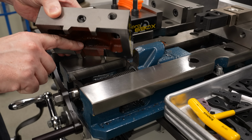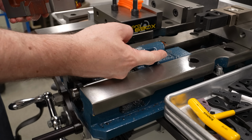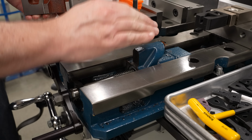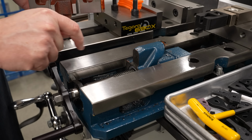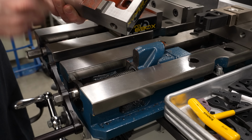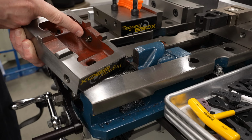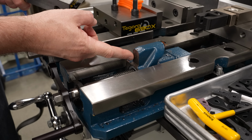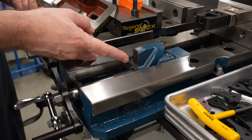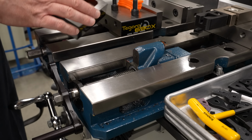You can see there's a little kind of a half sphere pad in here, and there's a hook on the front of the nut that's designed to actually push forward and pull the vise down simultaneously. And when you're actually pulling, this little pad right here on the back bears against this set screw with a spring, and that's where the force is actually being applied to open the jaw. It will bottom out and it will actually pull, as you saw, but it's not ideal.